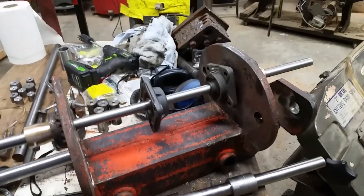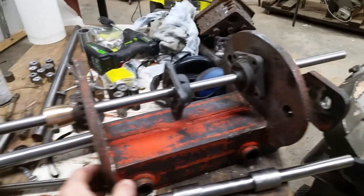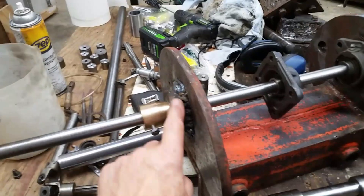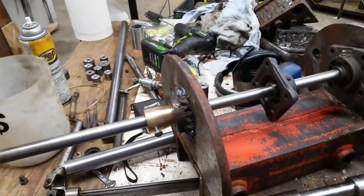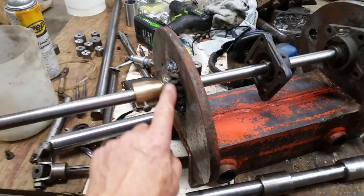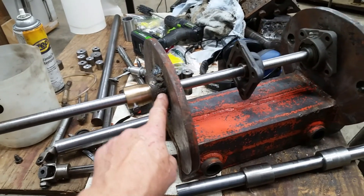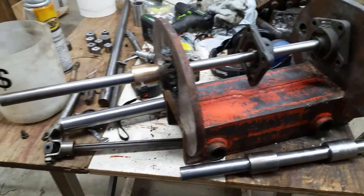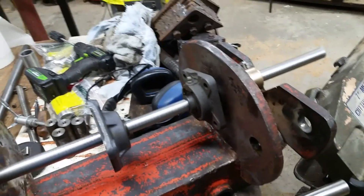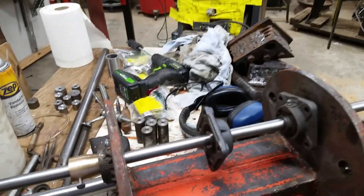Because I want to make this freestanding, I have to give you some context. This backhoe piece had bosses on both sides with bushings in them. At some point, the person let it wear so bad that even the bosses wouldn't hold new bushings, and they had welded the bushings into the boss. So I cleaned everything out, got back to an inch-and-a-half hole on both ends, and decided I was going to rebuild this.